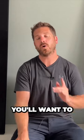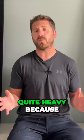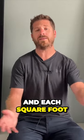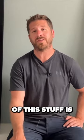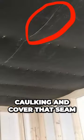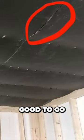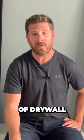Before doing that, however, you'll want to add a layer of something called mass-loaded vinyl. Mass-loaded vinyl is quite heavy because it comes in a roll, and each square foot is either one or two pounds. After you've added your mass-loaded vinyl onto the ceiling, get your Red Devil caulking and cover the seam in between each layer of mass-loaded vinyl. Then you should be good to go to add your next layer of drywall.